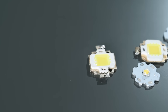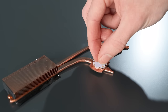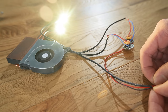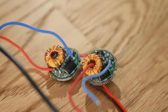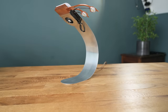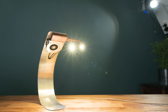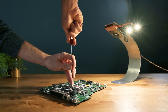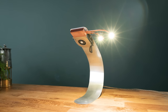Small LEDs like this have various power level options and as mine actually use 10 watts of power each, they would burn up very quickly if powered up on their own. But once mounted onto the heat plates with some thermally conductive glue and with the fan wired to spin up, they can be powered indefinitely thanks to the high level of cooling. Don't forget to use an appropriate LED driver circuit though, or you could still fry the LED with too much current. I attached mine to a curved piece of aluminium to make a stand, and it turned out to look pretty cool thanks to the different materials and a visible cooling system. This makes for a fantastic light to use while working, but it could also make a great desk lamp too, particularly if you're interested in computers and want a lamp made out of recycled parts.